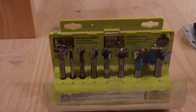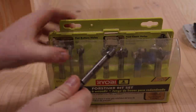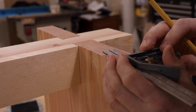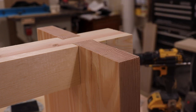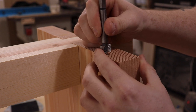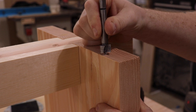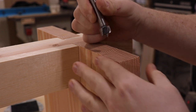The first thing we're going to do is grab a 5/8 inch Forstner bit. I'm going to mark an inch and a half in, then work on setting my bit — I like to let it overhang just a little bit. Another thing that works really well is to take another piece of wood and put it right here; it gets you a really clean edge.